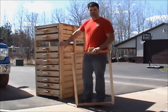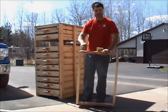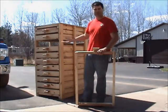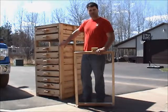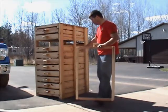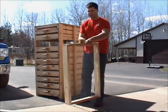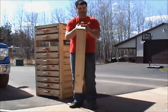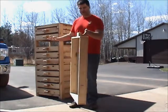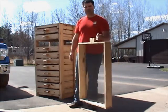The gaps between drawers are about 5¼ inches apart going up, to account for all the material in the shelf plus a little extra for the shelf to slide. The runners are ¾ inch by ¾ inch square pieces of wood screwed at every drawer height so the slats have something to run on. The handles are simply a 2x4 — I used my table saw to cut a little L-shape out of them to make a handle, very simple.